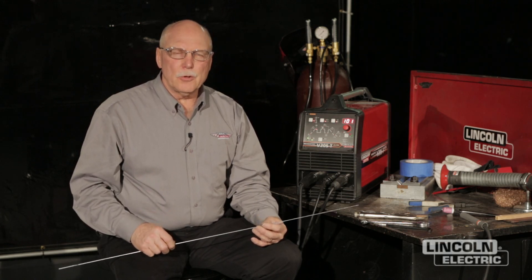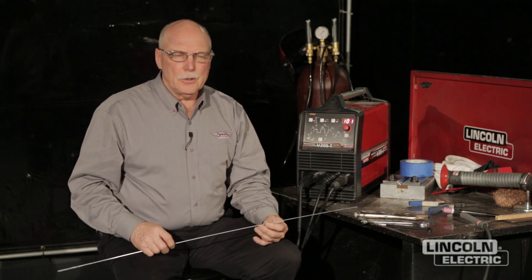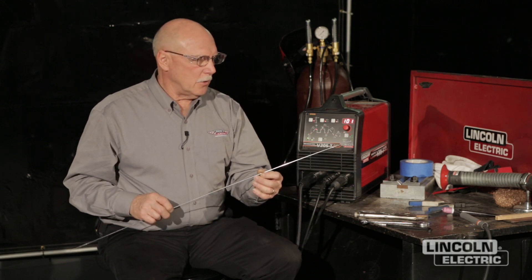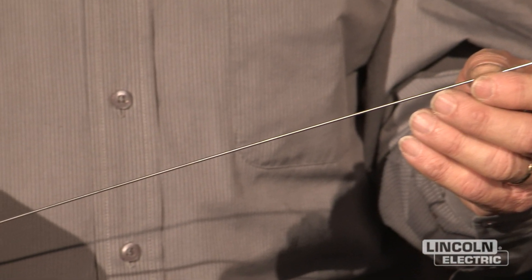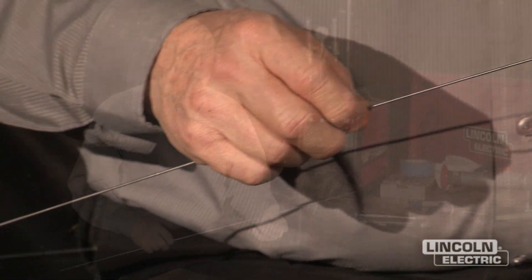We go to a special filler rod, and a special filler rod should probably be in everyone's filler rod box if they're TIG welding. You don't need a lot of it, you just need to have some of it. The filler rod I'm talking about is 312 stainless steel. 312 stainless steel has been a problem solver for years in lots of maintenance departments and maintenance issues across industries.